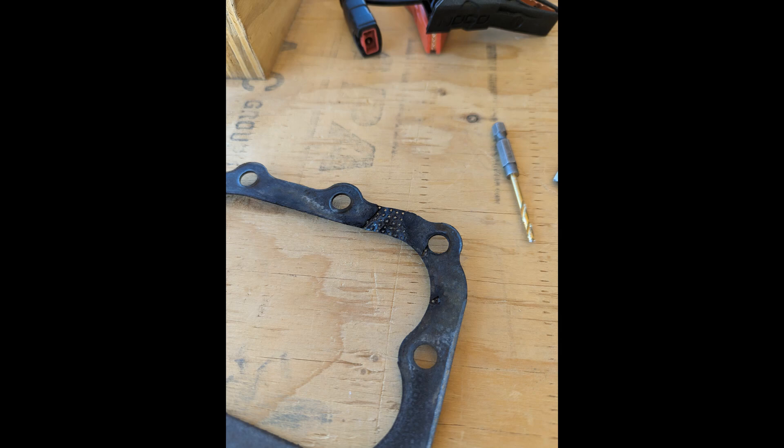Here's the head gasket that we took off first, and it's obvious in the upper right corner there that the head gasket is totally eroded from blow-by. And there's a piece on the lower right below the upper right hole as well that was starting to erode. This made me start to look at the head to see why the head gasket got ripped away.